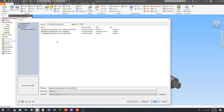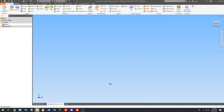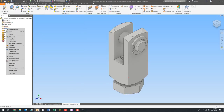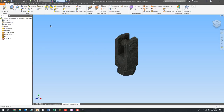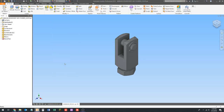Now we're going to open again and open the clevis file. We're going to do a similar process: click OK, delete the default sketch, set the material to steel, and then because these are zinc plated, I want to set the appearance to zinc.